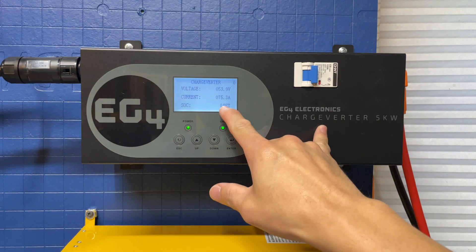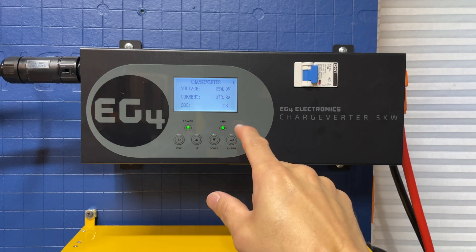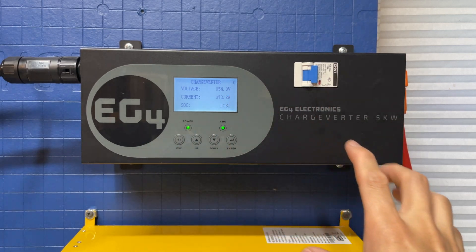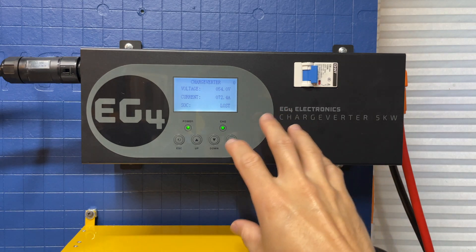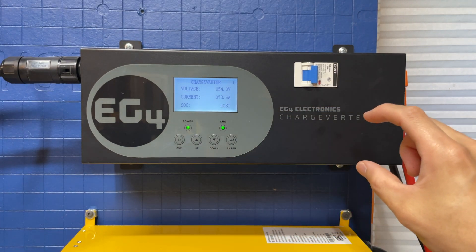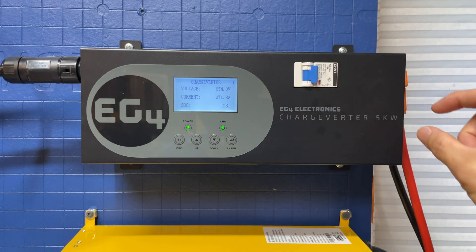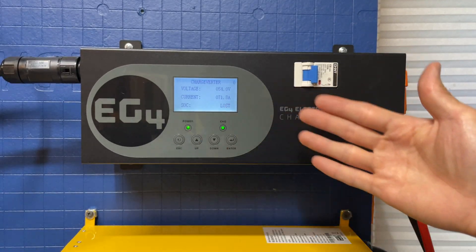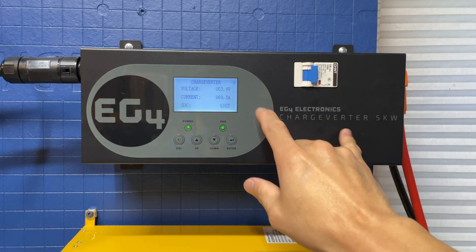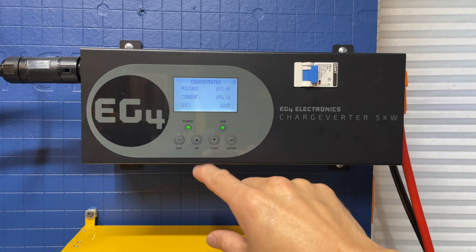As you can see right now, we're only really about 74-75 amps, hovering around there. That's mainly because my battery bank is still pretty full. If you don't ever get to 100, it doesn't mean your ChargeVerter is broken. Most people with lithium iron phosphate or lithium-based batteries know that the higher the state of charge is, the more difficult it is to charge at a higher current. That's why it's easy to get from zero to 80%, but to get past that 80% it actually takes a lot more effort. So this is not broken - it's only happening because of my battery bank's state of charge.